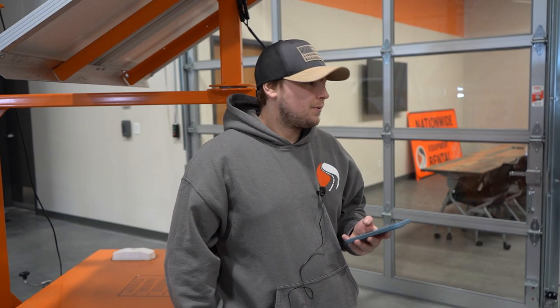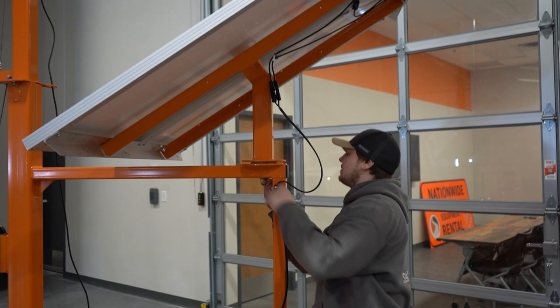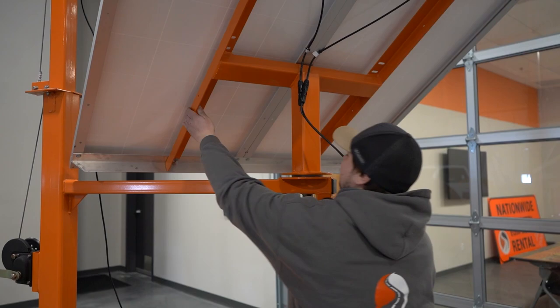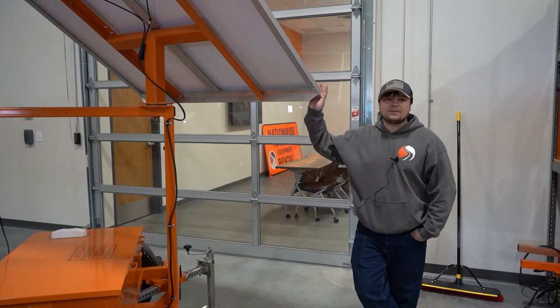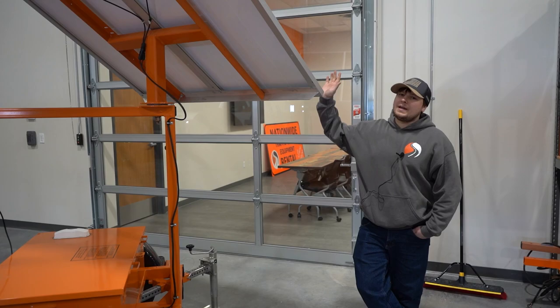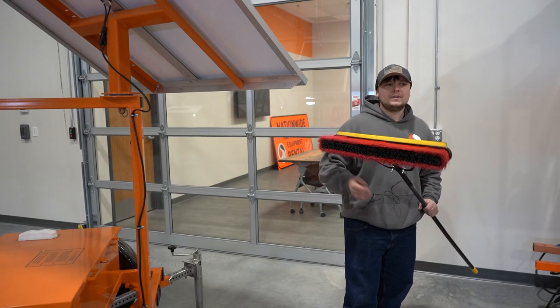The last thing we're going to do is find south. I have a compass app on my phone — you can see that way is south — so we're going to rotate the solar panels. There's a pin here you can pull down and then the mast will rotate freely. To get optimal performance, you're going to want to have them facing fully south with no obstructions from trees or any sort of building that's going to cast a shadow on the solar panels. In the winter, you're going to want to keep snow off the solar panels; the best way to do this is to use the bristle end of a broom to clear them off.